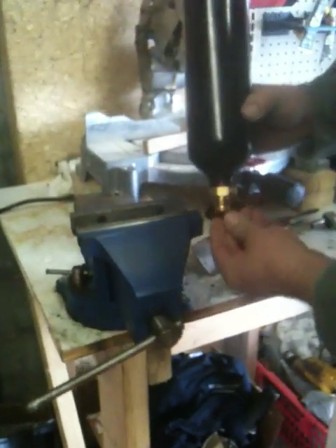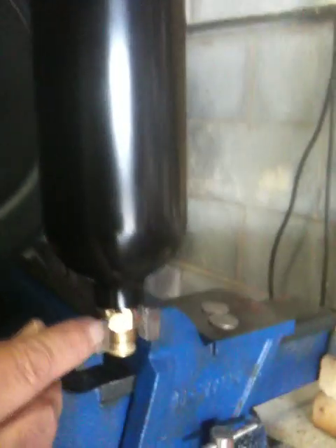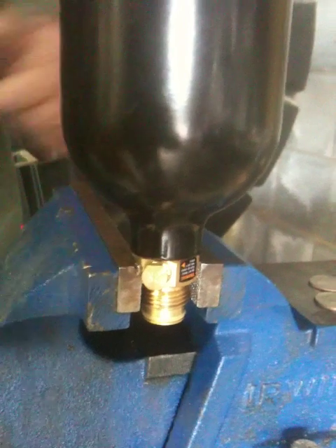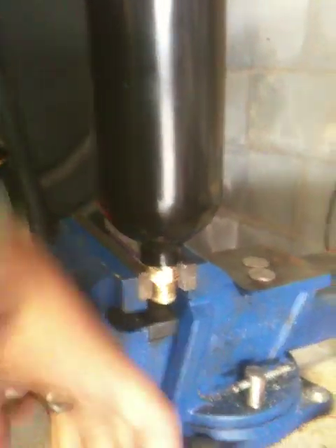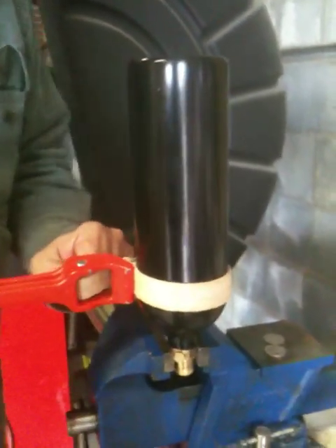You need a vise, like this vise. You need to carefully put the hex fitting of the pin valve in the vise and get yourself a good grip on it. Make sure they can see that there's a possible interference there, so be careful. This little nut sticking out the side is a 3,000 psi pressure relief valve. So if the tank ever got to 3,000 psi, the excess pressure would bleed out through this pressure relief valve — much like a pressure relief valve on your hot water heater, designed to blow before your whole tank blows. So you put it in there good and tight, then put a strap wrench on it. The strap wrench allows you to get a good hard bite on it, and you give it a good strong push.